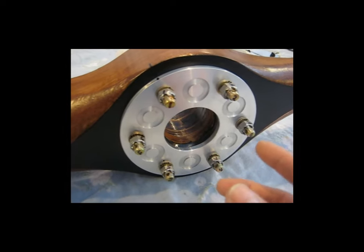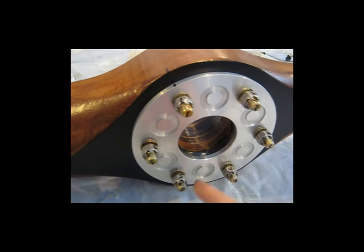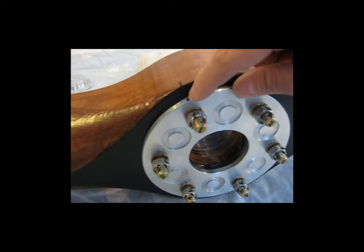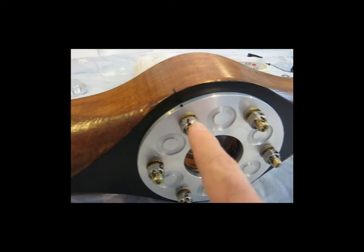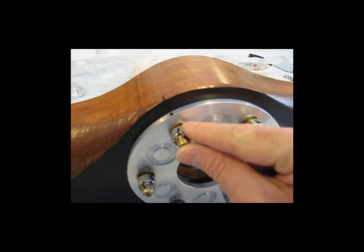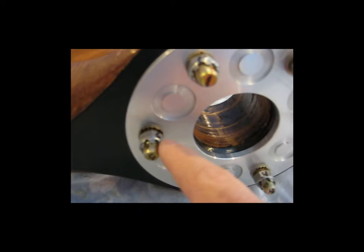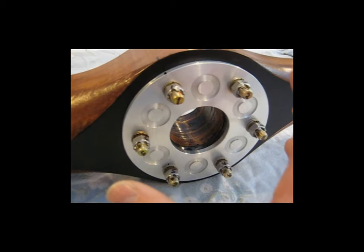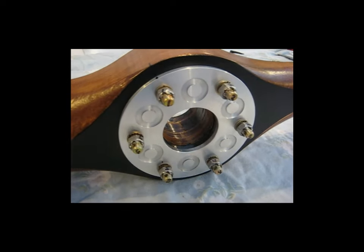Just to give myself peace of mind, I've decided to go ahead and mount the bolts, nuts, and washers and mark their location in relationship to the faceplate and the propeller. I've got a reference line here and a reference line on the faceplate, and off of that reference line I numbered the nuts and bolts going clockwise, and then I put little black tick marks on the washers — washer one through six with corresponding tick marks. Again, probably not necessary, but I just felt better weighing and balancing as much as I could to stay as accurate as I can be.